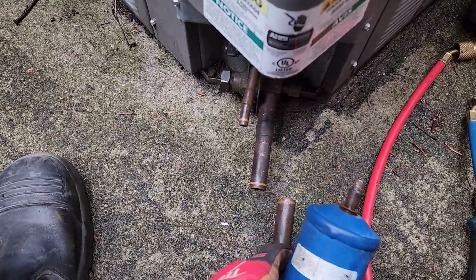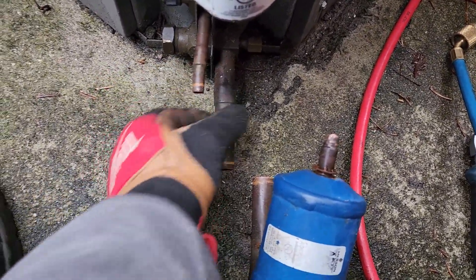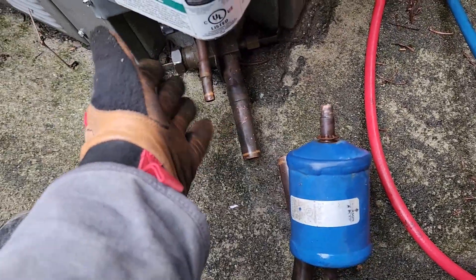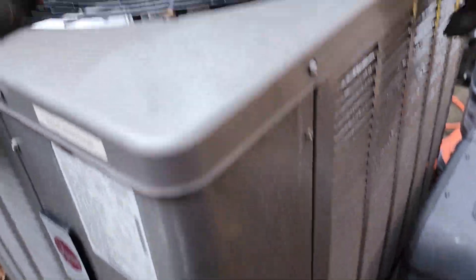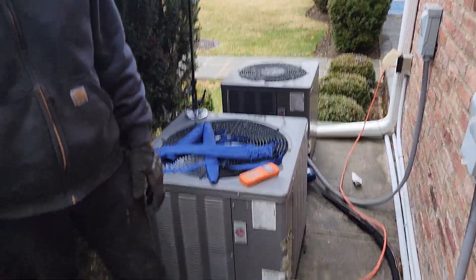The electrical is disconnected. I disconnected them here because when I reconnect these, I'll just heat these up and pull this out. I have to replace the filter dryer since it's now exposed to the air. I think this would be the best way to do it — this is how I did the unit the other day. Now we have to lift this unit up and over, and then we can wheel it somewhere.